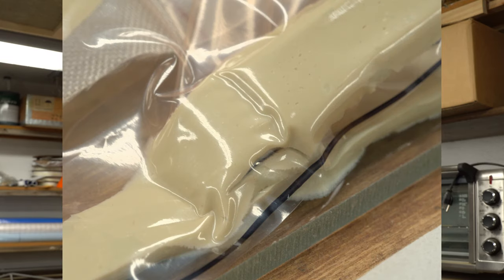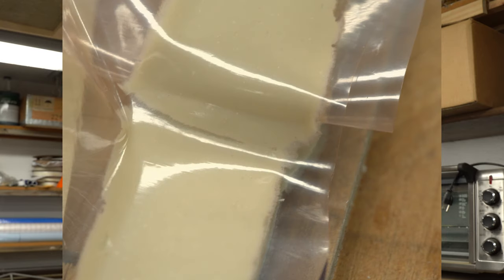If you don't put much pressure on that vacuum bag against the tacky tape, it can come loose. It may look good when you first press the tacky tape down into those corners, but if you leave your setup for a couple of hours or even overnight, when you come back and look carefully at those crevices you'll notice some have come loose — there's just a hairline separation all the way through that little crevice at the 90-degree joint.